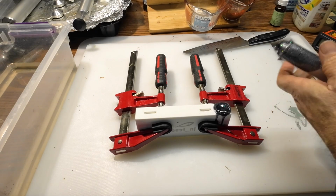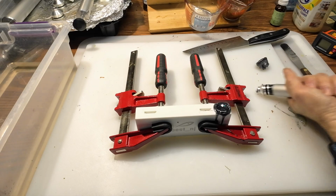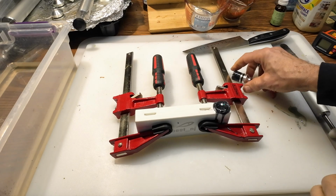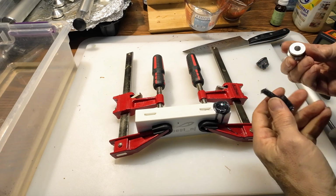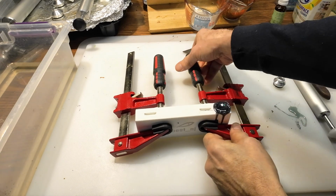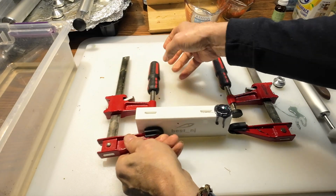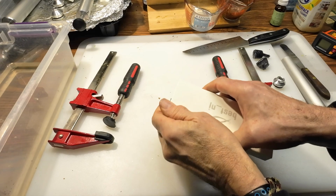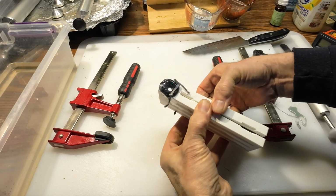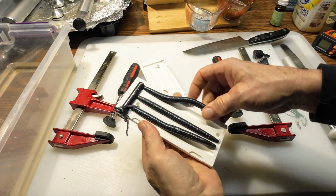All right, they should be cooled down enough now. It's cooled down to the touch. So usually just open up the injector first to see if it's cooled down. If it's cooled down in the injector, it's probably fine in there too. So a little bit left over in there, so let's just pop this open. Open her up, see how she did. And there you go.